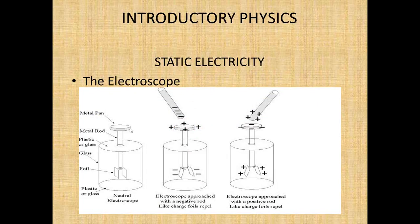This is the principle of the electroscope. If a negative device comes in proximity — this is charging by induction — the negative charge rod is going to repel the electrons from the plate, so the electrons go to the bottom. The leaves have the same negative charge, so they spread apart. When not charged, they hang together. With a positive charge, electrons are pulled up, the leaves get like charge, and they repel.